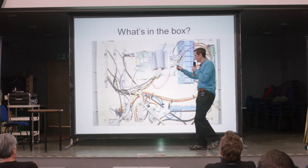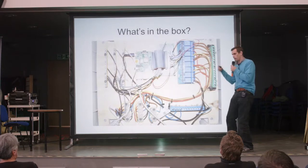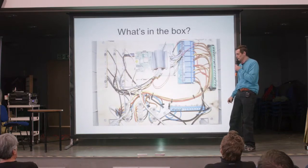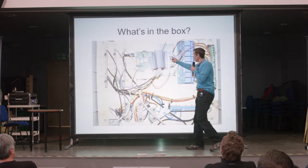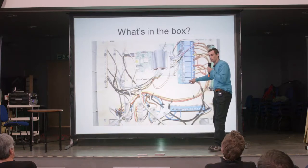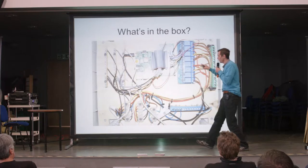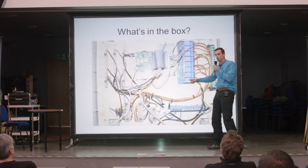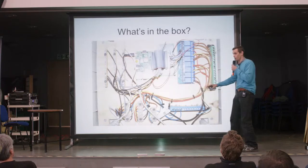I needed the diodes because I found out that if you turn on two of these channels at once, they start back-feeding into all the other ones, and then all these little LEDs on the relay board start lighting when they shouldn't. All of these diodes connect to one central rail here, which then also turns on relay 8 — and that's the one that controls the boiler. So in other words, if any one of these radiator valves are switched, then the boiler also comes on, because you need the boiler to work. That's quite important, otherwise you don't get any heat at all.